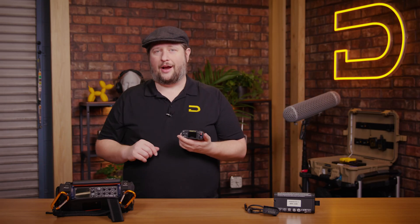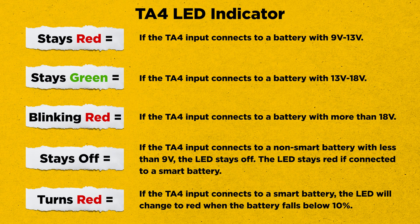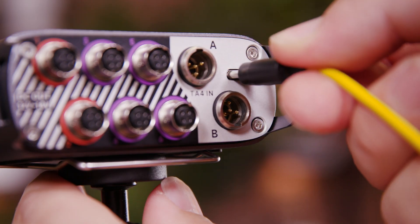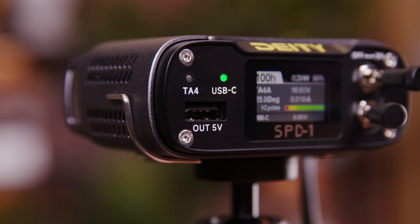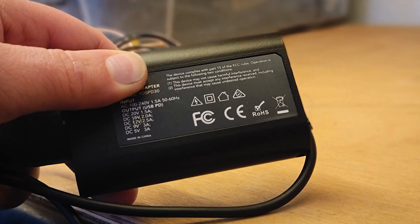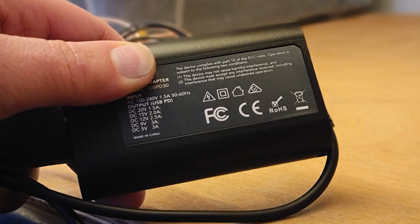If you get low voltage or have a question about whether a battery will work, the LED indicator on the front will tell you — you can check out the chart on screen to learn more. This device also has USB-C as an input, and you can see that LED right next to it. You need to be operating on the 12-volt USB-C standard, so check your power supply or power brick to confirm it delivers that.